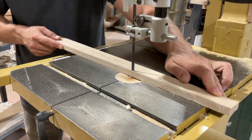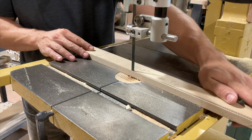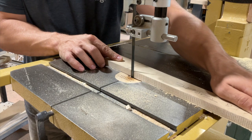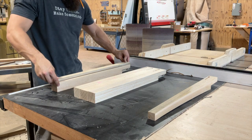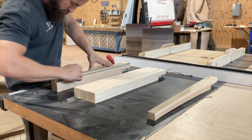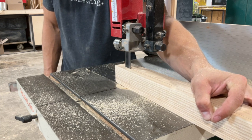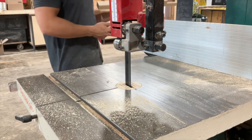On to shaping the legs in a different manner. I wanted to add some curvature to this table — just a little bit of subtle line to the leg to give it some character. I cut a template at the bandsaw, then cleaned it up with hand tools to get a subtle curvature. I rough this out with a pencil onto my legs — all of which already have the joinery done. Then I take it to the bandsaw and remove the bulk of the waste, staying outside my line about a sixteenth of an inch.